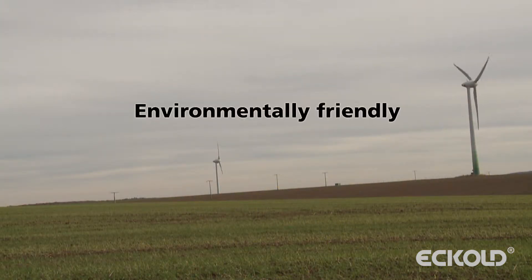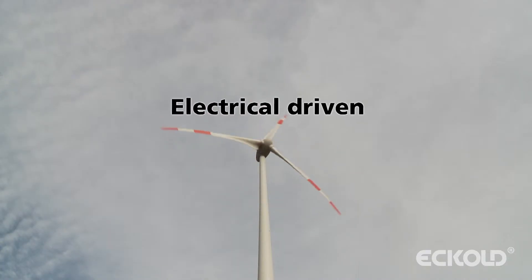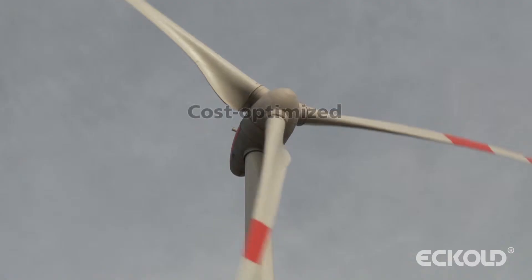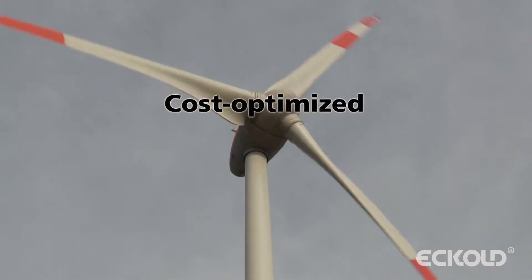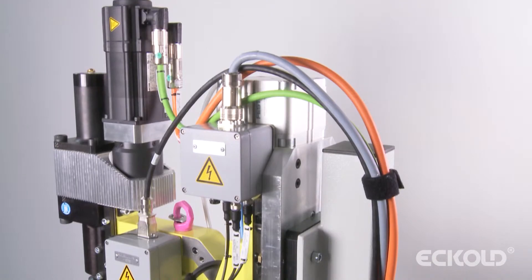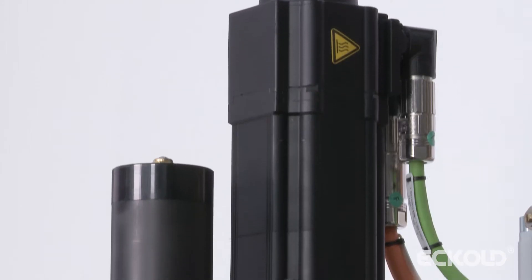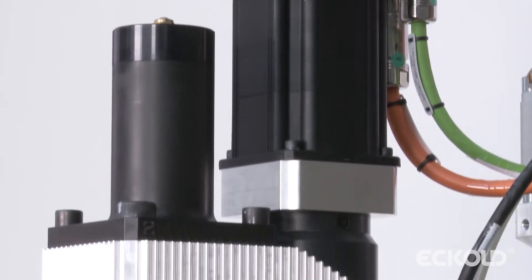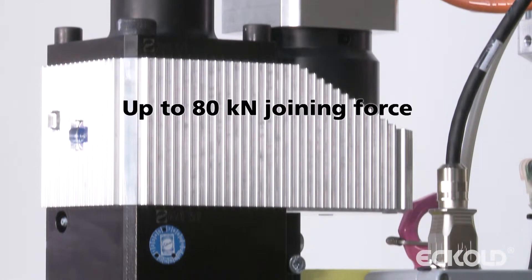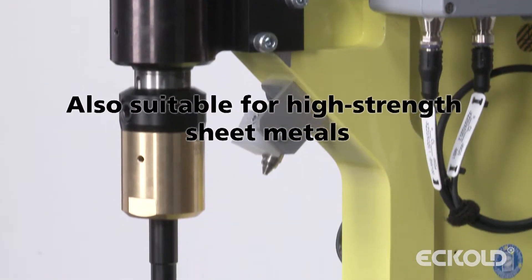Clinching is a sustainable technology that requires no process chemicals and works with electric power. Compared with conventional hydro-pneumatic drive systems, our machines are up to 30% more energy efficient. Clinching does not produce waste or emissions. The drive units cater for joining forces of up to 80 kilonewtons, so that even high-strength sheet metal parts can be clinched perfectly.